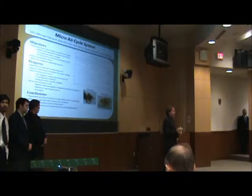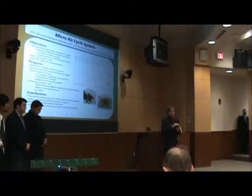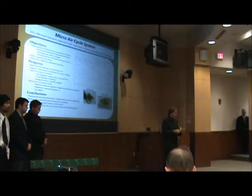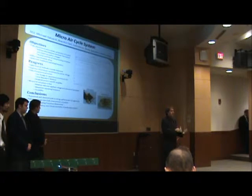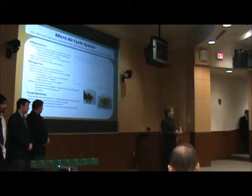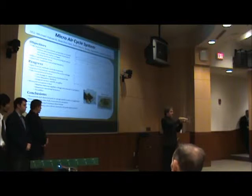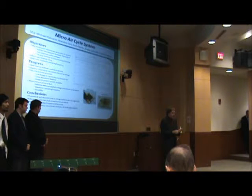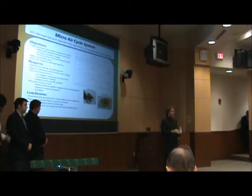For those of you who haven't heard about it before or haven't made it to some of the past senior design days: the prototype we have right now is a two-plate system where, as you apply voltage, the plates come together very rapidly. This semester we had two primary goals. One was to address the discrepancy between the theoretical pull-in voltage and the one we were actually observing in lab — pull-in voltage being the number, as you ramp up voltage on the device, that gives you that sudden suck-down between the two plates. The other objective was to characterize the actuation of the device throughout its actuation cycle.